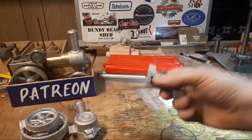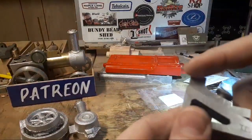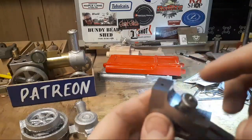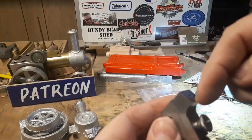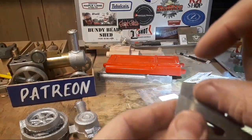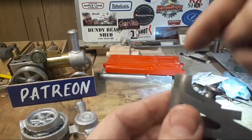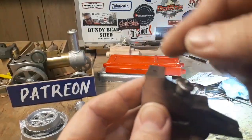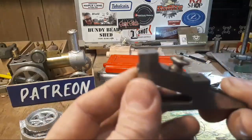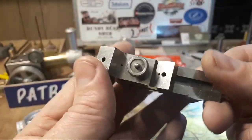If anyone has any thoughts on how to make a one-inch standard and a half-inch standard for this, which is what I'd like to put on it, just to screw in, or probably with a bolt with a screw in the middle, and just a standard precision block with a hole through it and a counterbore in the top, without using a surface grinder and cylindrical grinder and all those sort of things that everyone seems to have nowadays, and I don't. Well, hit me up on that.